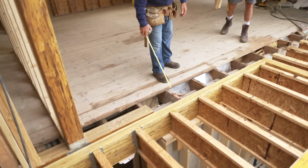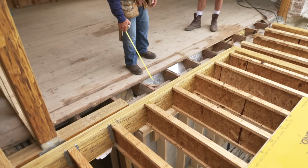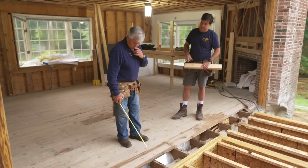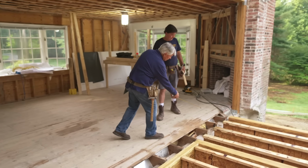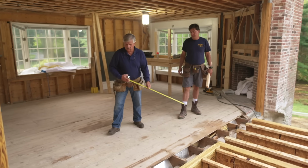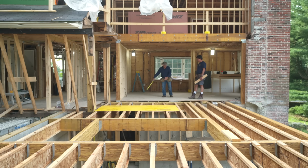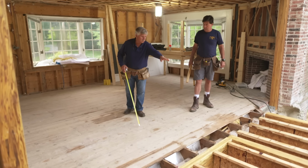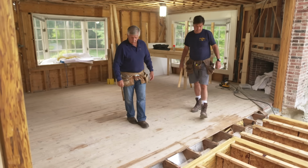There was the other option that I was thinking, that we can try to break these nails free here and see if we can pull up the joist, make it flush with here, but then we've got to worry about still cracking the ceiling. I think what we'll do is, you said this was about a half inch here? Yeah. And it goes up to nothing here? Yes. All right, so why don't we cut out a section of the floor? Let's come back here maybe 3 feet, take up these boards, and we'll either cut wedges to go on the top so they marry into the top of this flush here and they disappear down here, and we'll bring the new subfloor in across, and that should make everything straight. That'll work perfect. All right, let's pull some nails.